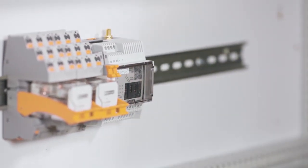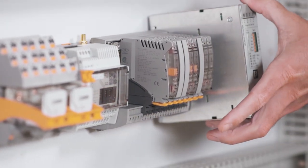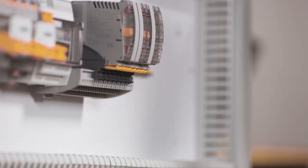There are tons and tons of components that fall into this category. In fact, just about everything you find in a control panel nowadays is DIN rail mountable. That easy installation Jeremy just showed you is one of the main benefits of using DIN rail, but it also makes removal just as easy. For that, you simply use a slotted screwdriver, lift up, which pulls back the mounting foot, and voila, the power supply comes off. So easy, even Jeremy can do it. One component on a DIN rail is one thing, but most control cabinets have a bunch of different components within them. And that's where the mounting and removal via DIN rail really, really starts to show its advantage.